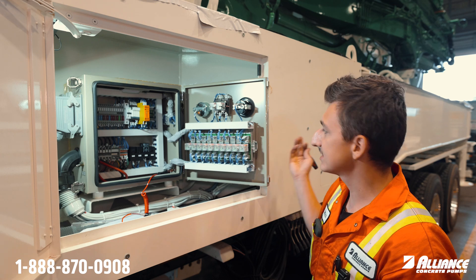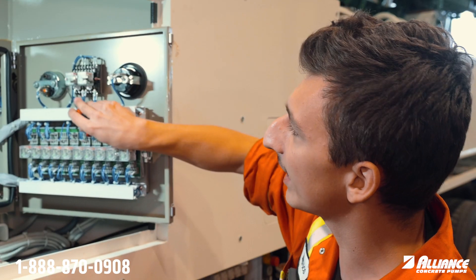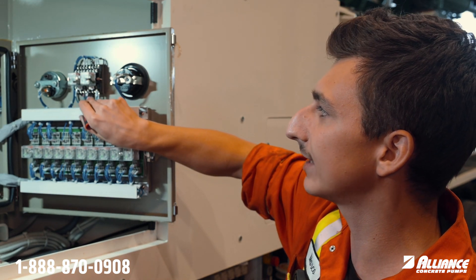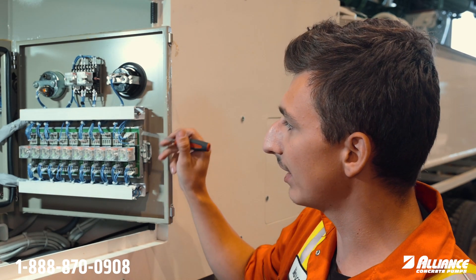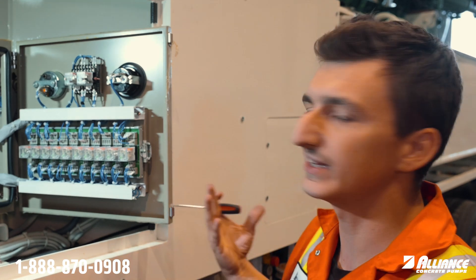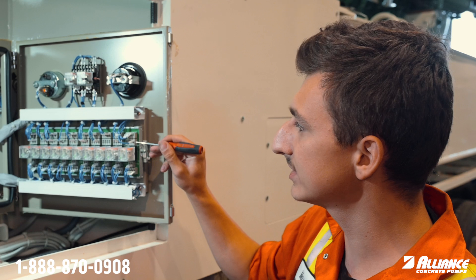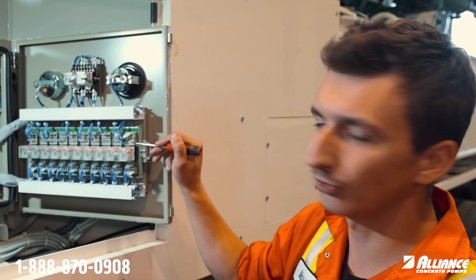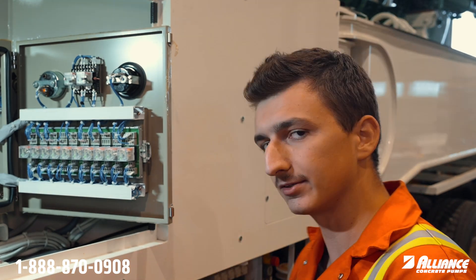That's the trigger system for the relays. Like I said, these two are a little different — we have the same thing just below the relays but they're a little more spread apart, so we have a trigger and then a ground for that relay. As for the three other rows, the bottom row is kind of a common — the input. We have the common rail, a normally closed, and then a normally open. So when that little green light is not lit, normally closed is active. When it's lit, normally open is active because now that circuit is closed.